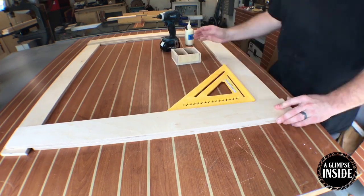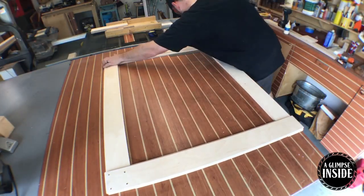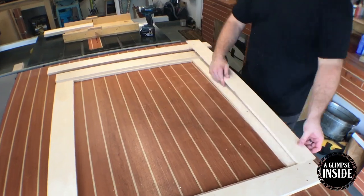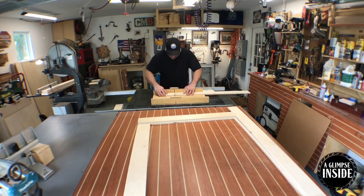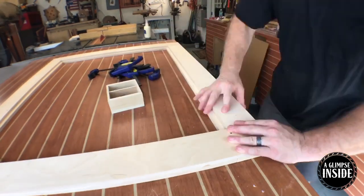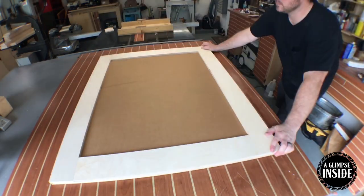As I start to put this together with some glue and screws, I make sure that each corner is square. These screws are three and a half inch screws and they are not going to be seen — they're going to be on the back of the frame. It helps to clamp the work piece down to your work surface, making sure that you're square by taking a measurement at the diagonals. At this point the thing is made except for the last two vertical pieces. Again, clamps, glue and screws and you're good to go.